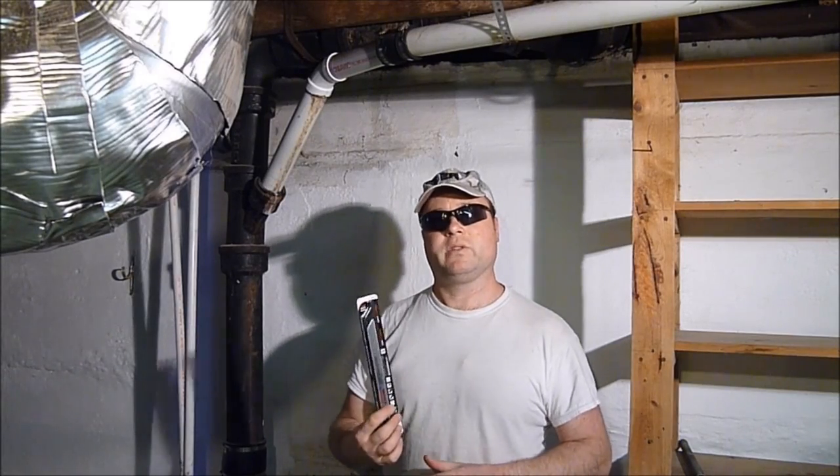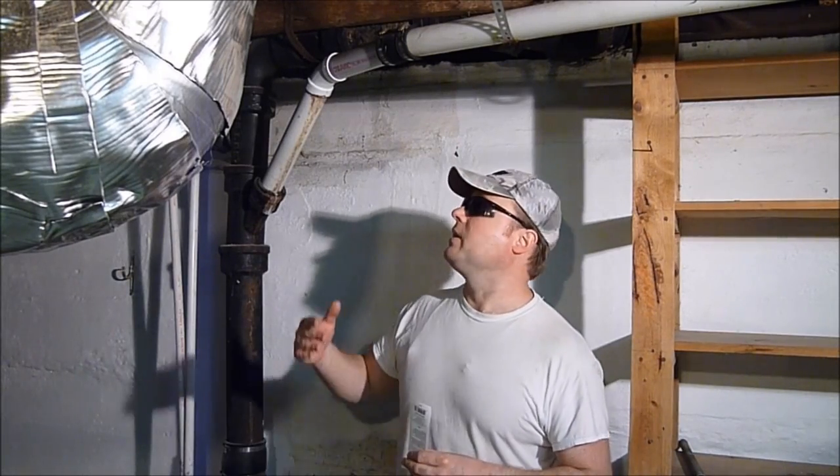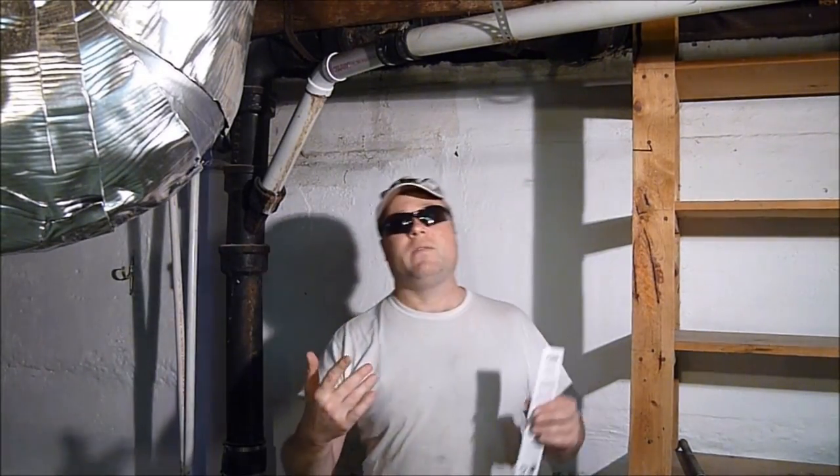So what I'm going to do is cut it with the sawzall. Now, you're not just going to take a regular metal blade. You can take a standard metal blade to a galvanized water line — the ¾-inch to 1-inch — and you can cut that with it. But cast iron will burn those blades up left and right. You'll go through three blades to make one cut.